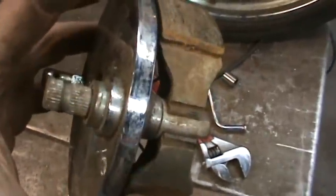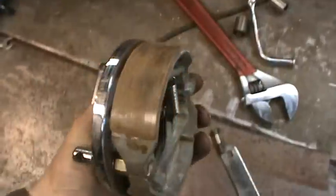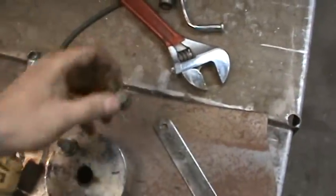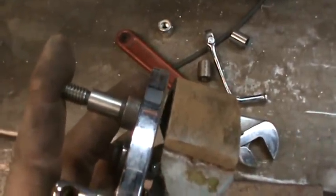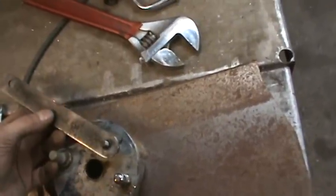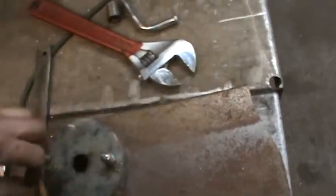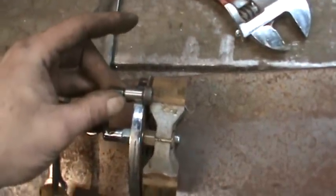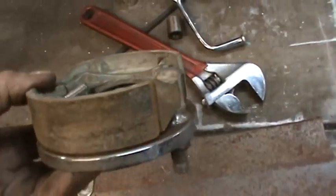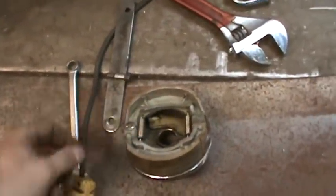I popped that drum out — it's steel, feels like steel, and it's chrome plated. I thought about welding to the outside but also thought about why not just drill right through it if we have room. I think I can tuck right under that brake shoe and go with something like a shoulder bolt coming through the other side. That's the lever he brought over that he wanted to use to tie back — I just have to open that hole up a little bit.